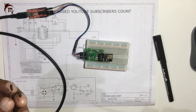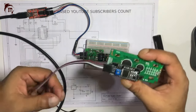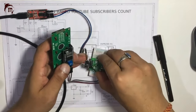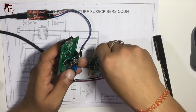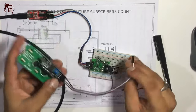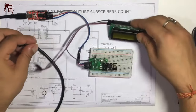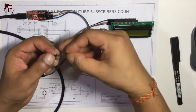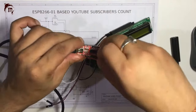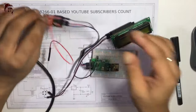Then you need to provide power. Your first one is your ground, so connect it with your ground, then your VCC, you need to provide 5 volt to your LCD. So we will take 5 volt from your USB to TTL conversion board.